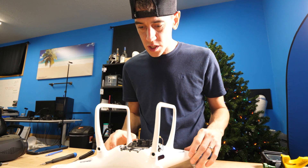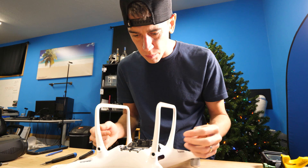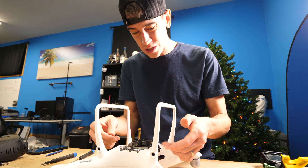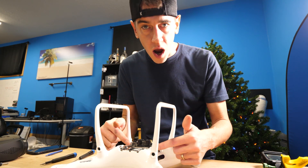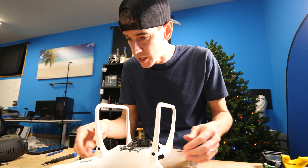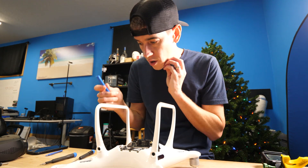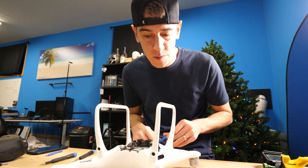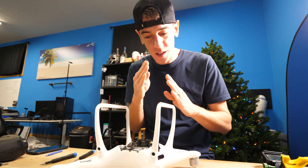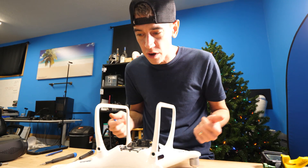I've taken out all the retaining bolts for the lower shell, disconnected the antenna cables from their sockets on the board, and extracted the two Phillips head body screws that hold this part of the lower shell onto the main board casing. Now what we should be able to do is start from the edge of the arms using a pry tool or a pick. You don't want to use something metal, especially if you're trying to reuse this case, because these clips connect two different ways along the seam where the top and lower parts of the shells meet.